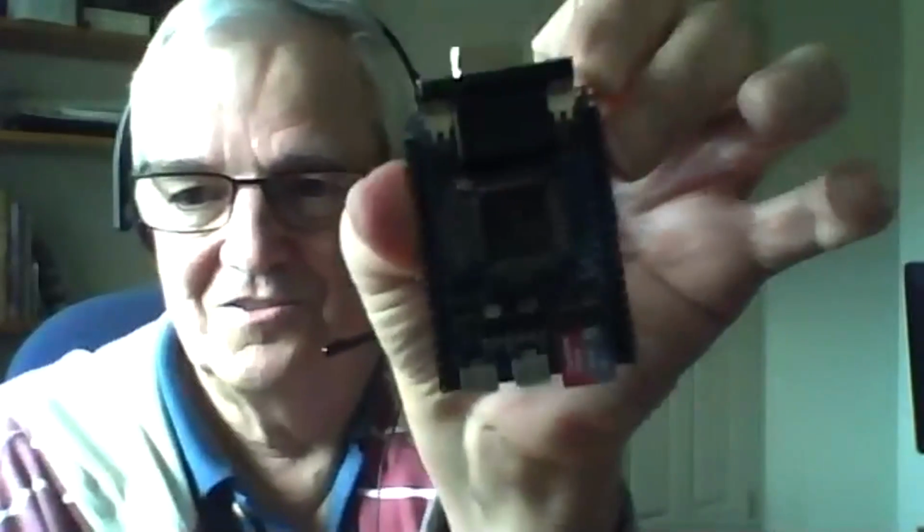That is my board soldered up. I use this little dongle that I buy for $1.50. It plugs into that little header and it can program it. Now, I've changed the pins on this little cheap board to be a mix of a socket with long pins. And I get power from that from the USB port. But if I want to disconnect the USB power, I have that little expansion header with a pin removed so it doesn't have power on it.